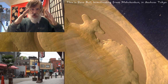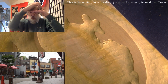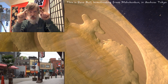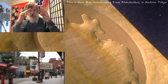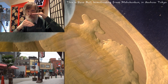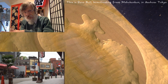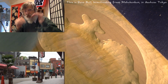Now when it wears out, instead of having the flat, like my hands there, good. Instead of having a flat top, these corners get rounded. So you've lost wood. So the area is now smaller, but as you go down, it gets wider. So you get what's happening here. Chon-san said, look, Dave, now that it's rounded on the corners, just plane off 1 millimeter. That'll take off the rounded corners. It goes down to an area where it's wider. Now paste on your tracing again and cut the exact lines where they should be. Just take 1 millimeter off.